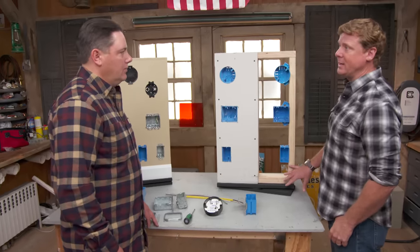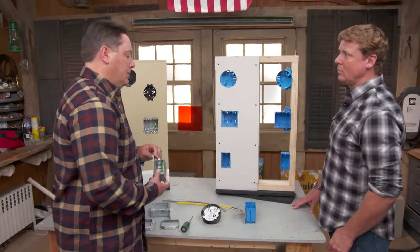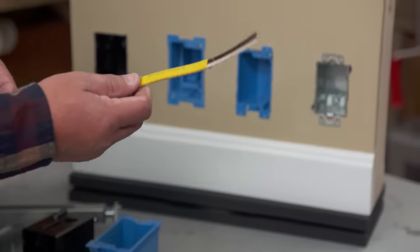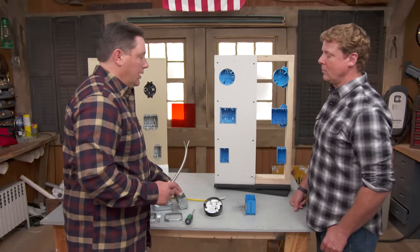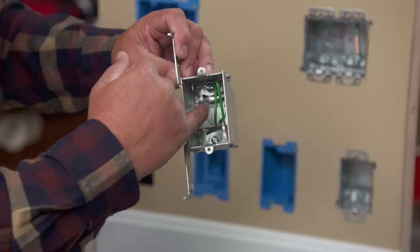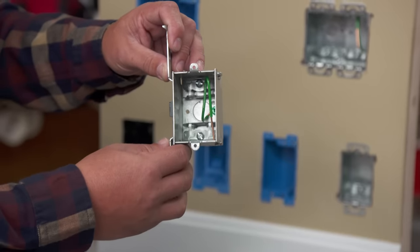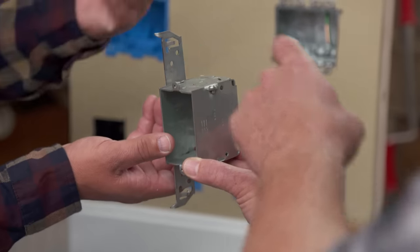They're usually always plastic? Not always plastic. We tend to use plastic more often than not when we're doing new construction, but sometimes you do run into metal — that is an option as well. It depends on the type of cable you have. If we're using non-metallic cable, we'll try to do the plastic. If we run into metal-clad cable, we want to use a metal box. The metal box is designed with a clamp to hold that metal-clad cable. It also accepts a ground screw, and that lets you ground and bond everything together. We want to make sure the metal box is grounded. This is new work as well, so you presume you've got enough room to screw through it into the stud.